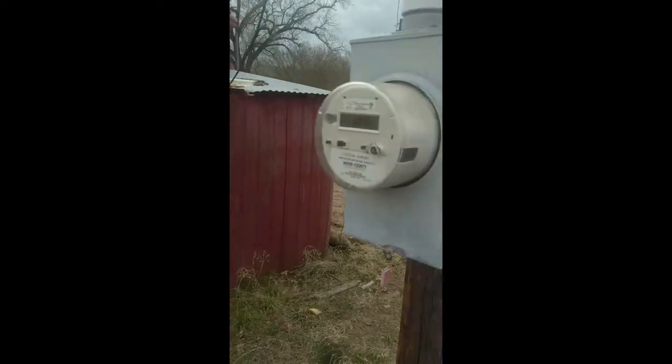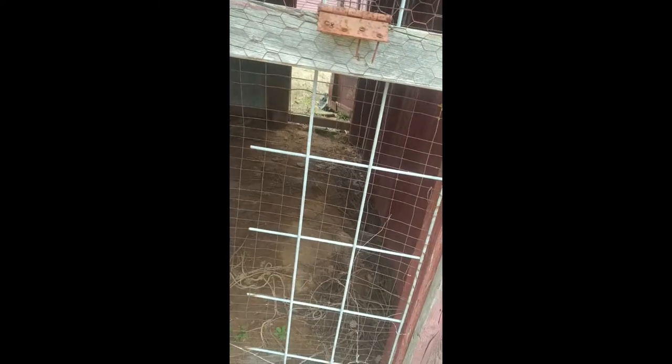This really needs some love. Let me start by taking the ceiling off and going from there. Here's the outside — you can see where the roof is sagging because the beams just rotted away. I've got some two by fours for the inside to help fix that. We're going to cover this up with plastic and make it a lot more weatherproof but still let in light. Now that I'm up here pulling nails, you can get a better idea of how this roof comes into the building, and we've got foam to go between the flashing.